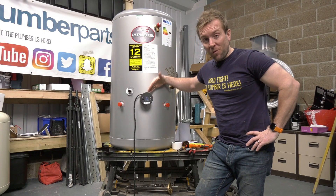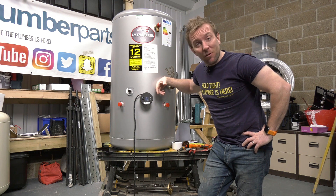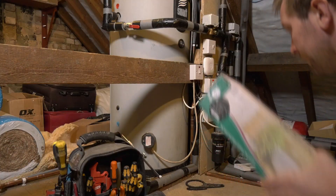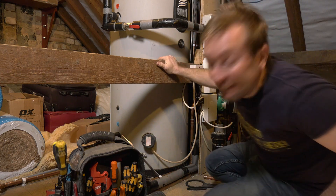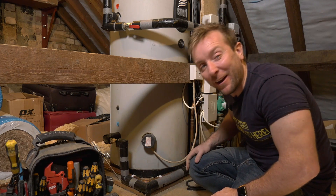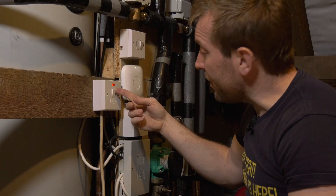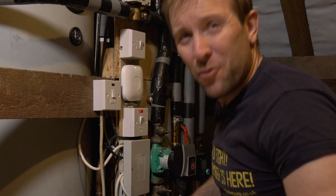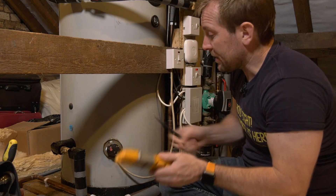You've seen how easy it is to install and set up on the app — I'm now going to go and fit one of these in my own home so I can monitor the hot water temperature and turn the immersion heater on and off without having to get up in the loft. Here we are in my loft — the insulation needs a redo, it's quite an old bashed-up immersion here, but it'll be great to update this so it can talk to the wi-fi in the house. The first thing to do — it's on at the moment, we've got the little LED light on there — we isolate it, pop the fuse out, and just to make sure, get the tester on there.